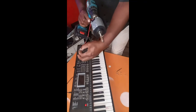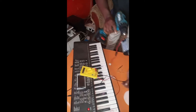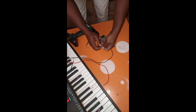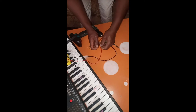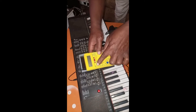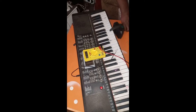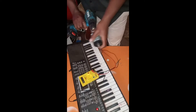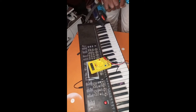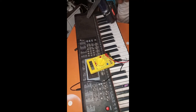So let's measure the power being produced by this motor. I have a multimeter here — I'm going to join the cables. Black goes to black, red goes to red. My multimeter is set on measuring direct voltage on the 200 volts mark. Let's see how much we get from this upon rotating. We've got around 8.6 volts, because the rotation of the drill is not that fast.